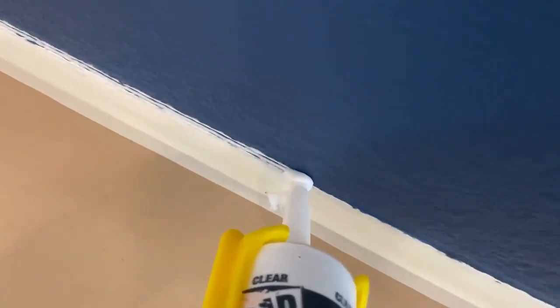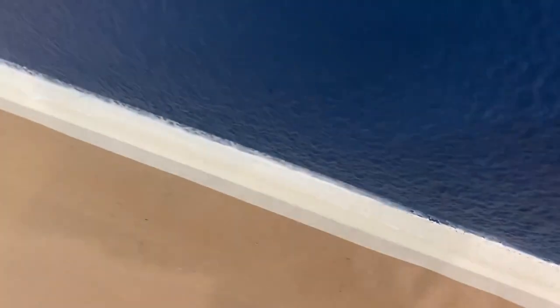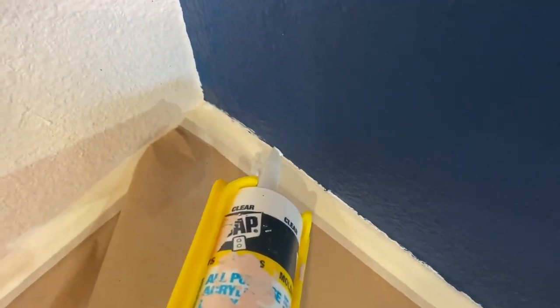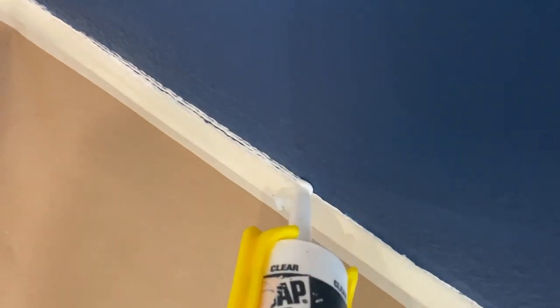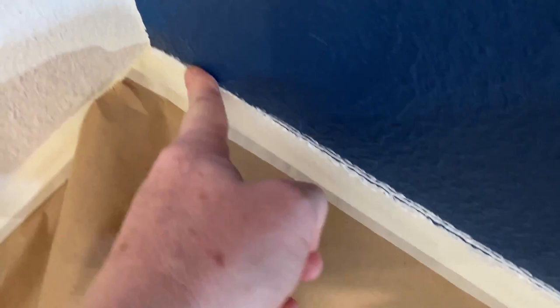When I say excessive, she just took the brush and painted up and down. But it was an excessive application, even though she didn't realize it. And what it did was coat the bumps on the texture so much that it obscured them, and it caused angular flashing, which, as I was saying before when I was working outside, causes the light to hit those bumps in a much different way than the light is hitting the bumps right next to it. And so you say, what's happening here?